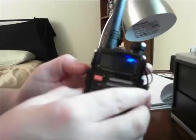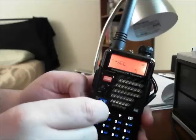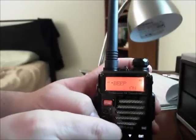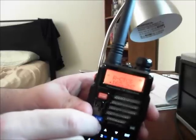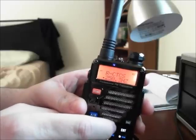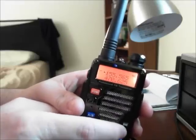I don't want to hit the transmit button because that's illegal. The frequency is 155.565 MHz. You hit Menu, scroll to item 11 — R-CTCSS — hit Menu again, and it will show CTCSS. Then use the up or down arrows to navigate to 162.2 Hz, confirm, and hit Exit.